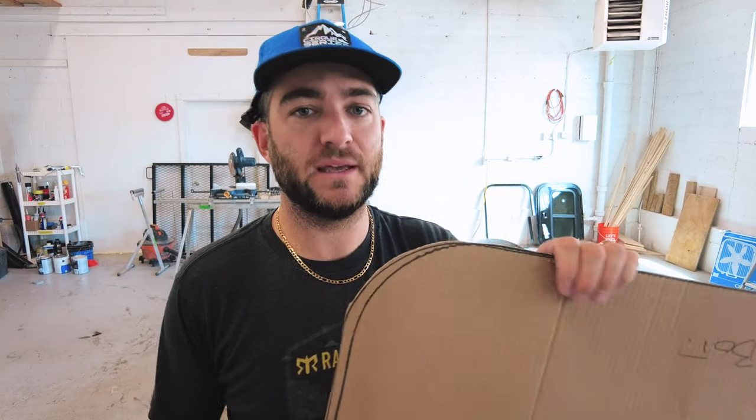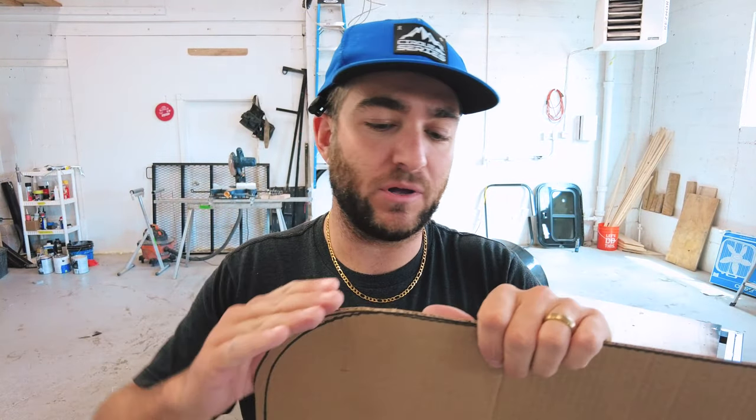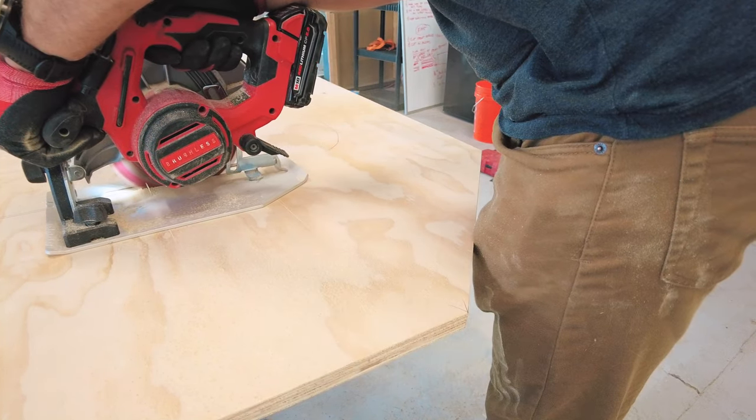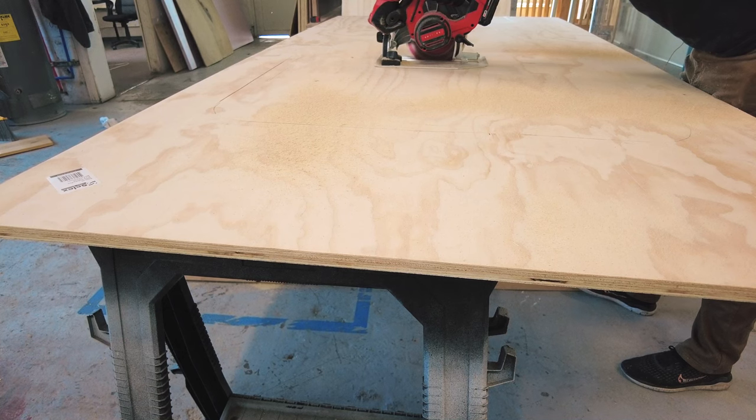What I'm going to do is cut with maybe an eighth of an inch around the outside of my template. I'll put my plywood down, mark my template, and when I'm cutting I'll just eyeball a little bit bigger than that. It's okay to eyeball because this doesn't need to be exactly perfect — it's all going to be covered up with that door trim anyway. I then use a plunge cut with my circular saw to cut all of the straight sides of the door opening.